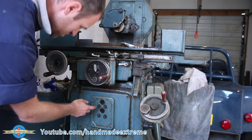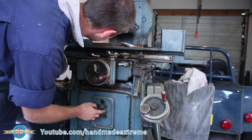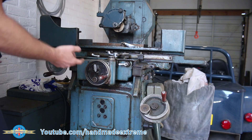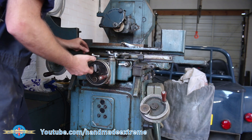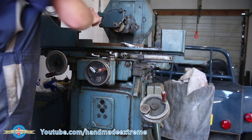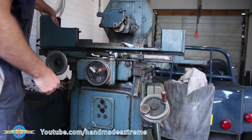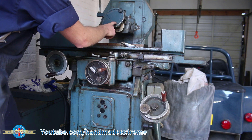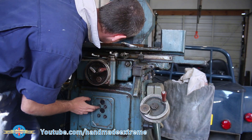Let's just try. That's doing something. Ah right, that's the spindle. So that does the spindle. Presumably that does the hydraulic system. Yeah, that's doing something. Maybe the motor's going the wrong way. This is supposed to be going clockwise so that the sparks go into the spark guard. So if that's going the wrong way, that might be why the bed's not moving as well. Let's have a look at the spindle.